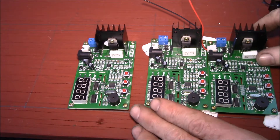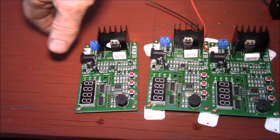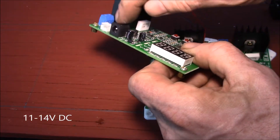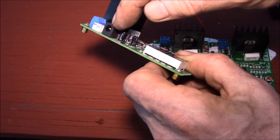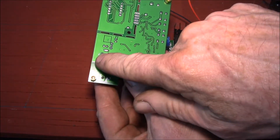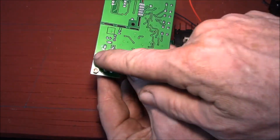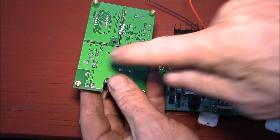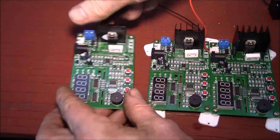Mike's DIY Power Wall had a really neat idea with these. These devices run off of up to 12 volts — there's also a 5-volt USB version. They take a single 12-volt power supply, and on the back here are the two pins from the power connector, so you can just jumper a number of these boards together and power them all off of a single power supply.